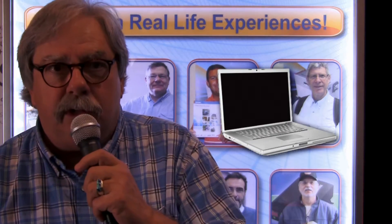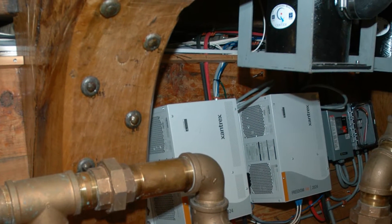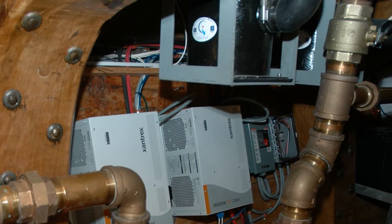Most people, when they buy a cruising boat, they'll start out with a certain number of appliances and they may add appliances later on. So you're going to need more inverter capability. With these units, you can stack them in a parallel configuration and take, for example, a 3KW unit, add another 3KW unit and parallel link them and you end up with a 6KW configuration.